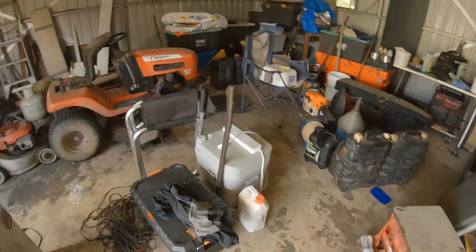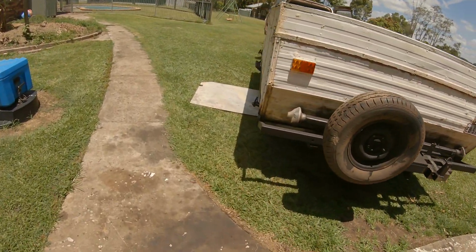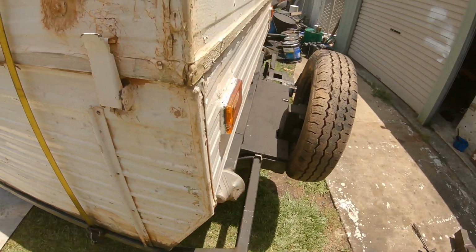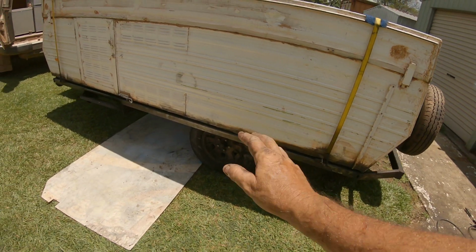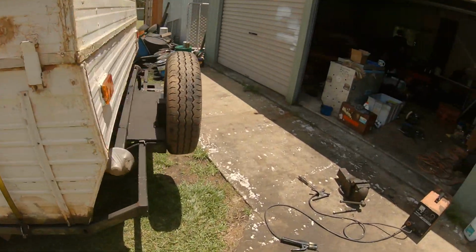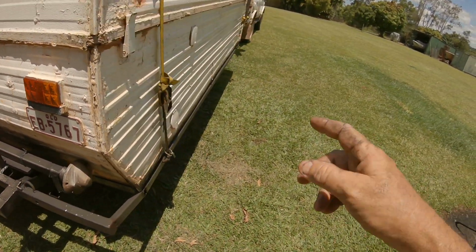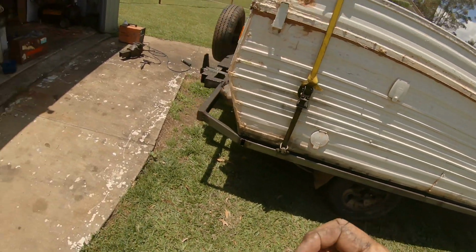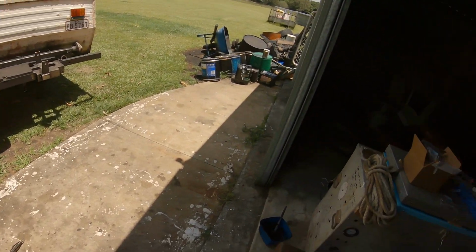It's just, you see so many people. Then I carry a complete set of wheel studs and wheel nuts as well. And if I had to, I can interchange. These hubs will go straight on there, because they're what you call a Delco. They've got a Holden inner bearing and a Falcon outer bearing. But these are a Falcon inner and outer slimline, and they'll fit those same hubs. The bearings interchange. The outside diameter is the same. The slimline just allows you a slightly bigger 7/8 axle, I think. Oh, I could be wrong there. It might be even a bit bigger. Forget what measurement it is.